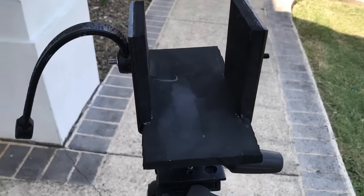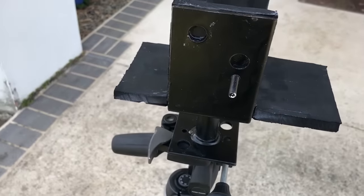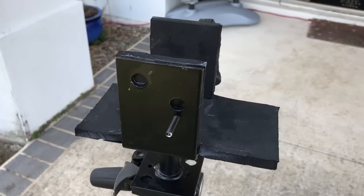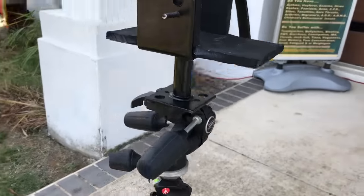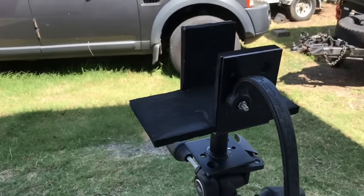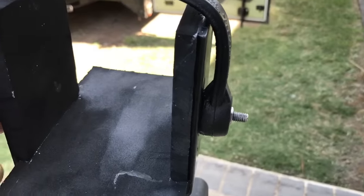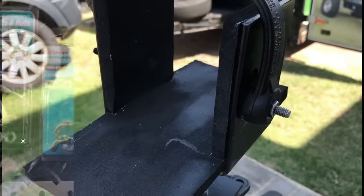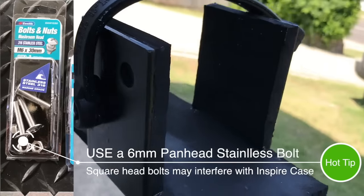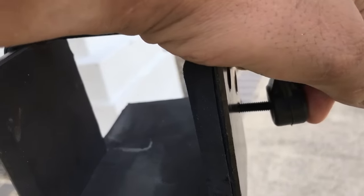Now that we've put the foam in, we had to use a little bit of superglue in a couple of areas. We've given it a lick of paint — because it's galvanized we used an etch primer as a prime coat and then just a little bit of satin finish, and it looks quite reasonable. There's a little strap that goes over the top — we bolted those through, tapped the casing with a six-mil bolt, screwed that through, and lock-tighted it all in. On the other side we left the bolt open so we could just literally click that over the top.